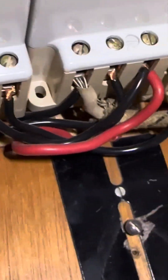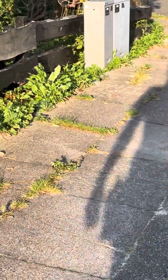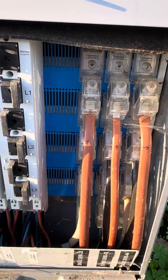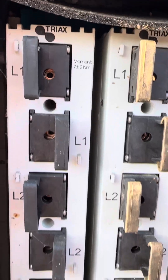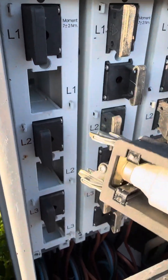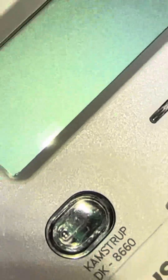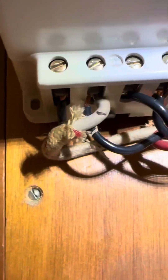The house is from the 1960s with a few original cables but mostly newer ones. To disconnect from the meter I could remove a panel and go in there, but instead I went to the roadside and found the fuse running into the entire house. In Denmark we use three phases — very common for one house to have three times 35 amps — so I simply removed the fuses there and the meter was dead.